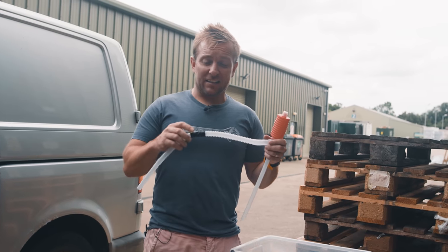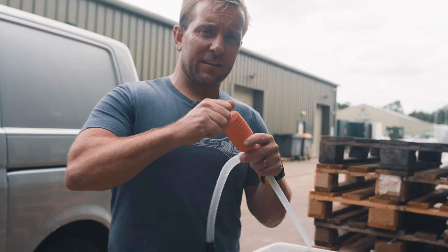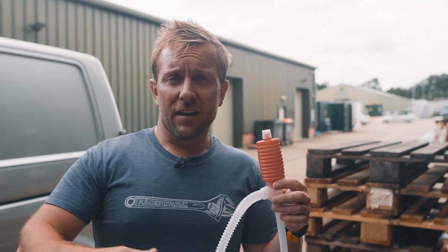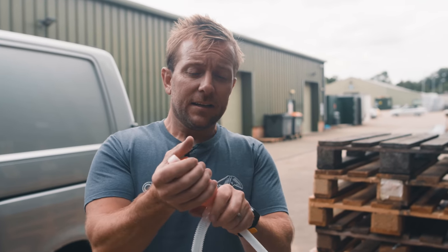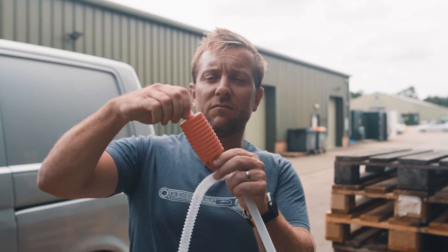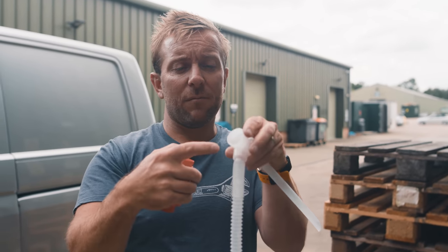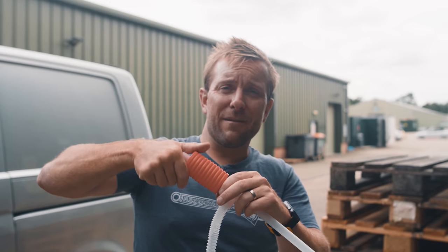So this one here I accidentally burnt, which is why I've got a little bit of gaffer tape around it. But it doesn't mean it doesn't work anymore. Let's have a bit of a closer look at the beast. These do two things: they pump, but they can also initiate a siphon, which is really handy if we're trying to get water out of a tank in a loft and there's nowhere for it to go quite easily. Siphons are very handy things. If we take the pump bit off, this is our pump. This here is our siphon break valve, so we can shut that and keep the siphon going, or we can break the siphon just by letting that off and allowing air in. And then in here we've just got a little non-return valve that flaps open and closed, so it doesn't let water back down. And that is pretty much it.